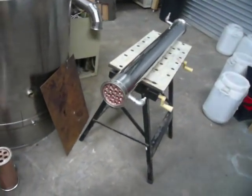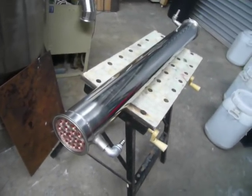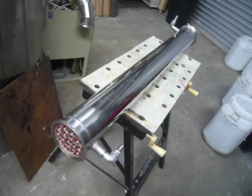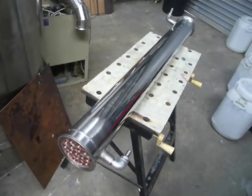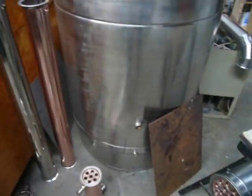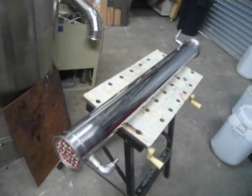So there you are — that's done and dusted. I've got some new tools in the box with silicon bronze brazing, and a new mantra of using silicon bronze for every single copper-to-stainless join I do, within reason. I'll catch you in my next video — we'll probably be clipping this whole thing together and doing a reflux run with the new copper column and new reflux condenser. See you then.